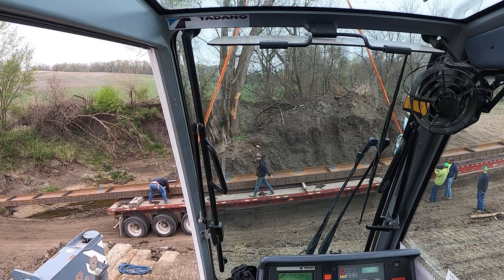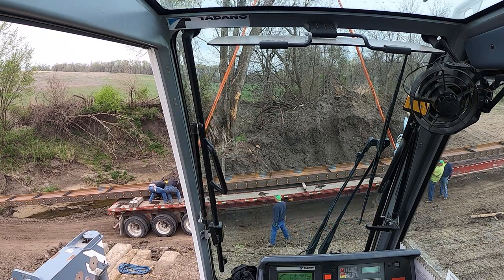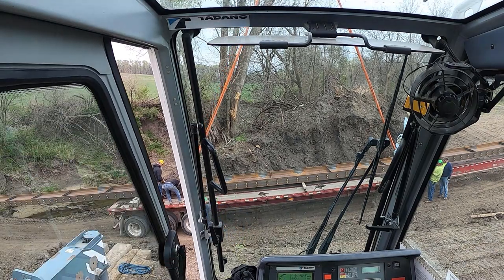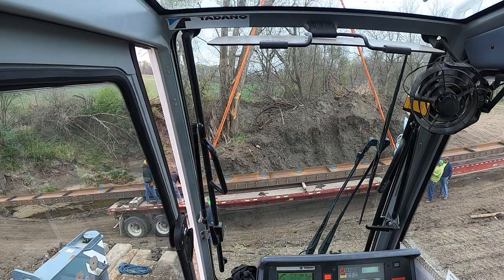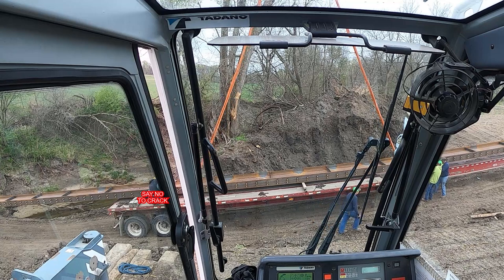The bow against the sling. So you put the bow of the shackle against the steel choker, that way as it's pulling tight it doesn't try to unscrew the pin in the shackle. If you don't do that, then it can actually physically try to unscrew that shackle pin.